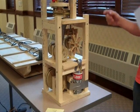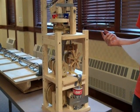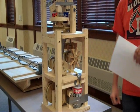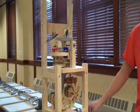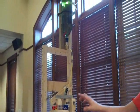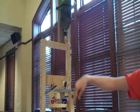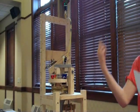We're team number three. We named it 'Shot Happens' — it is an automated shot dispenser. All together we have shafts, belts and pulleys, bearings, gears, and a cam follower arrangement. The input comes in, gear reduction on the bottom level, power distribution on the second level, and the third level is where all the actual action happens: fluid is up top, flow-stopping mechanisms here, and a carousel for all the drinks, which get filled intermittently each cycle.